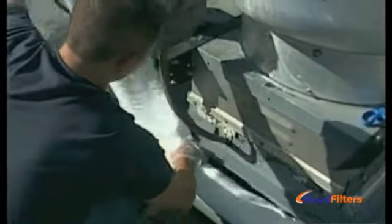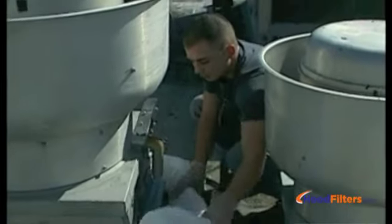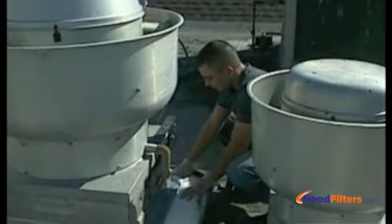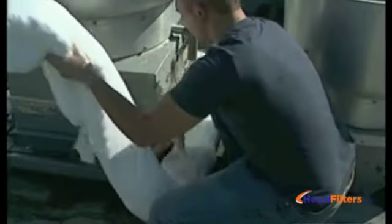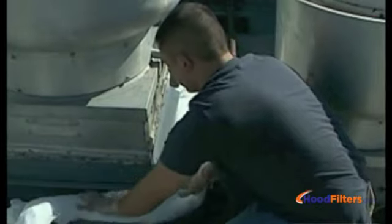Make sure to push the boom into the corners too, so it makes contact with the corner walls. As you install the boom around the gutter, continue to push it to the bottom of the trough. This is very important. The boom must make contact with the bottom and the corner walls of the trough. Otherwise, grease might get past the boom and spill out on the roof.